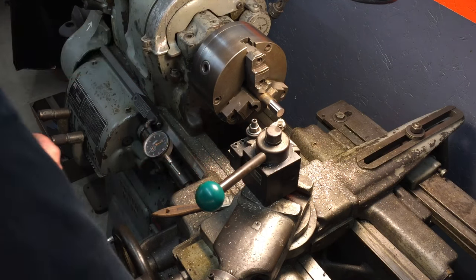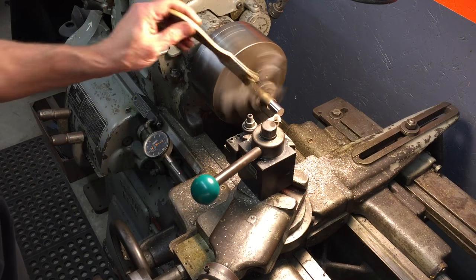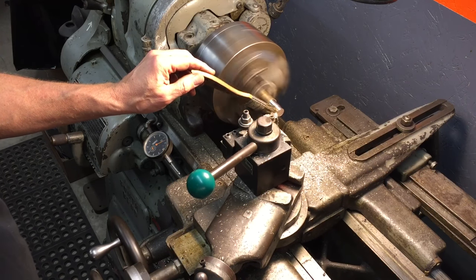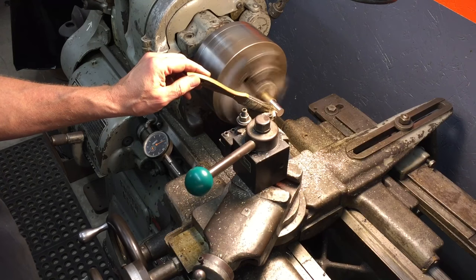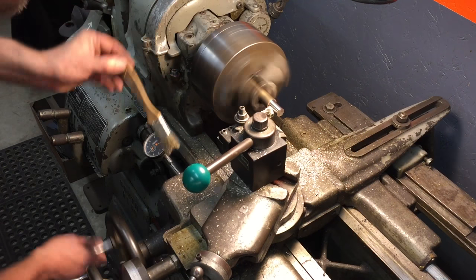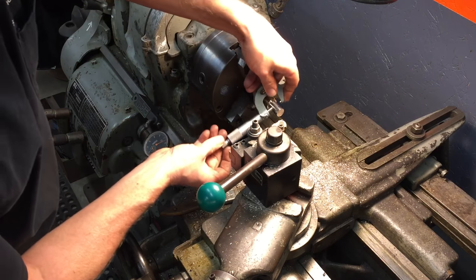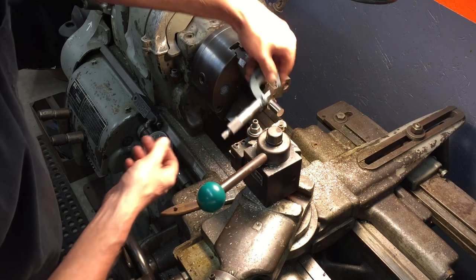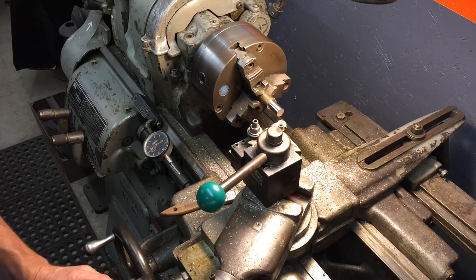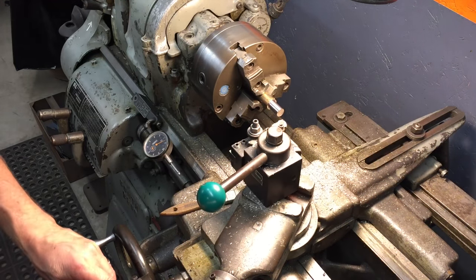650, perfectly. Now we know this is going to be right, but we check it anyway — measure twice, cut once. So it is 602. I can live with 2 thousandths too big. So this next pass will be our final pass, because we said 602 and we are going to 550. It says 150 here, we crank her over to 200.